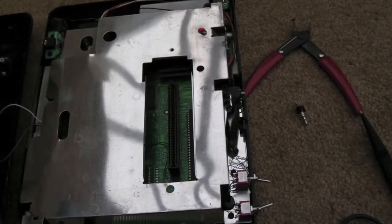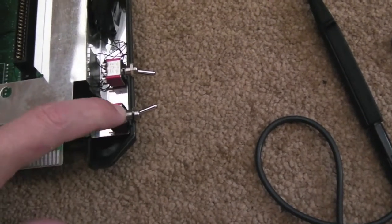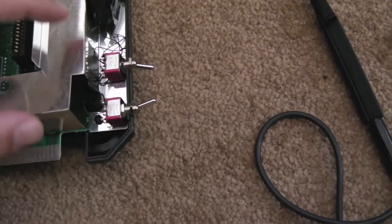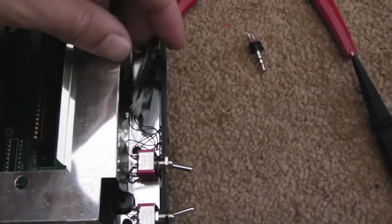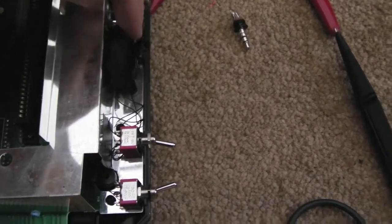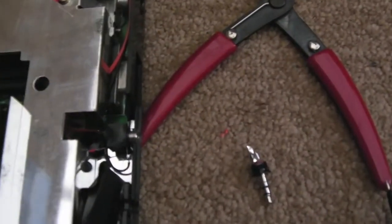So in the meantime I got on with and completed a couple of mods on my Mega Drive. As you can see, I've got a couple of switches — one for PAL/NTSC, or 50/60Hz I should say, and the other switch is for the overclock. You can see the little crystal there, just held with a bit of PVC tape — a 10MHz crystal so I can overclock it.